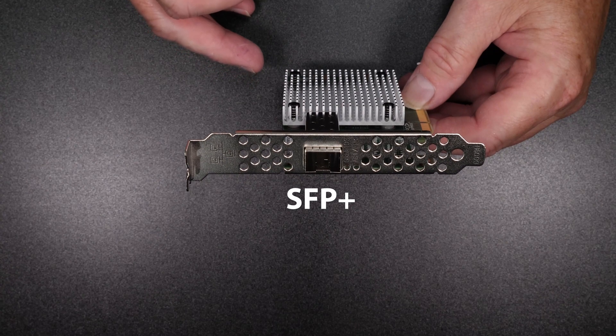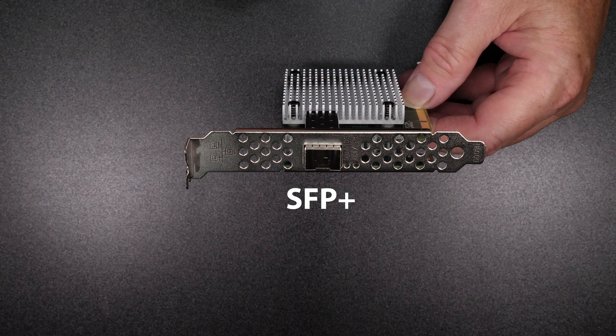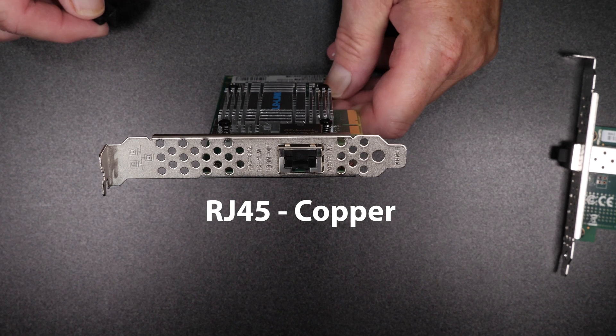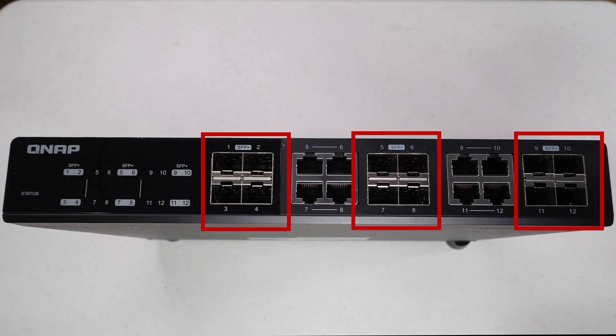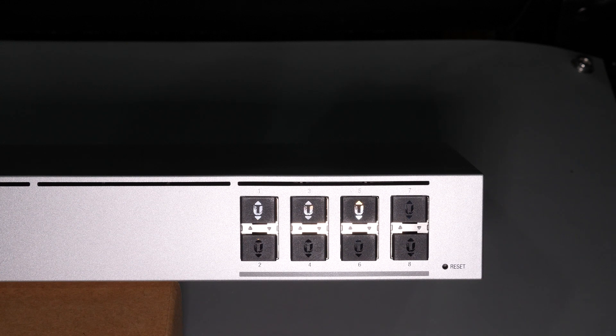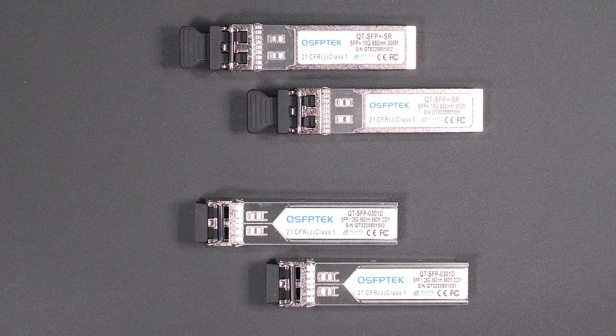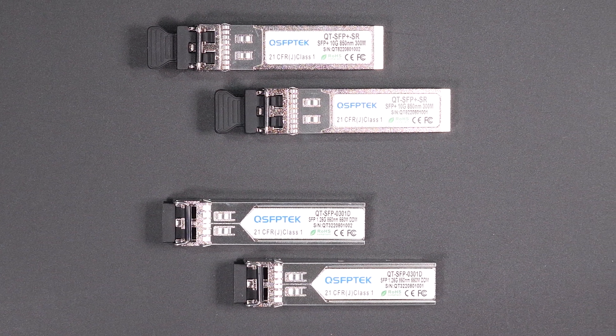One of the main considerations when migrating to 10 gigabit or when working with mixed 1 gig and 10 gig environments is deciding what type of switches and devices to use. Some manufacturers, especially PC vendors, use copper RJ45 type connections even on their 10 gig cards. Many NAS and switch vendors use what's called an SFP Plus connector, which tends to be a little bit less expensive, more flexible, and runs over longer distances, but it does require the use of a transceiver. Today's video will cover a few different types of transceivers and discuss when to use them as well as the advantages and disadvantages of each type.